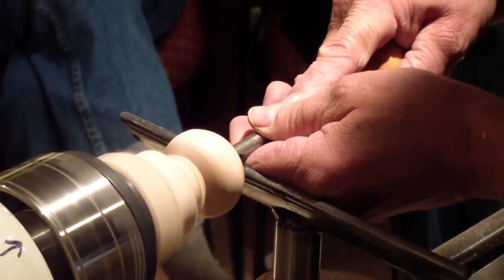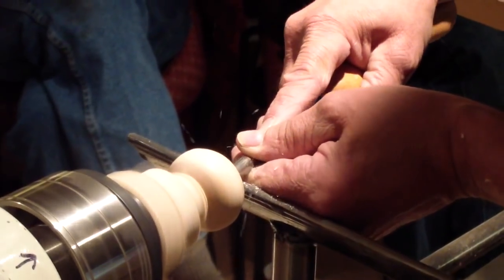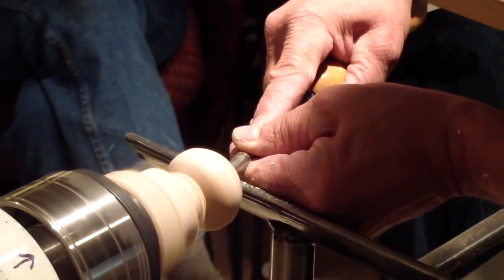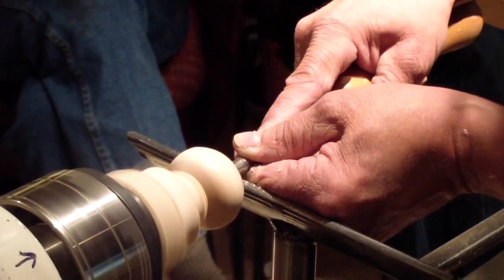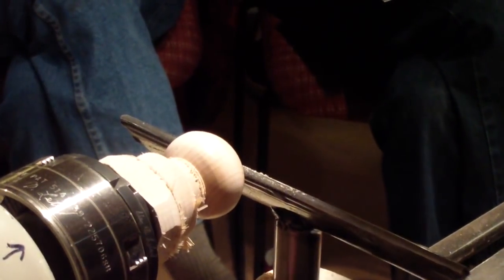And this guy's very aggressive. He can do the hole inside. It's a much smaller cutting surface, but it takes way more wood out than any of the other tools, a lot quicker. It's very aggressive. And once again, I'm rocking it back and forth, mimicking that outside curve.